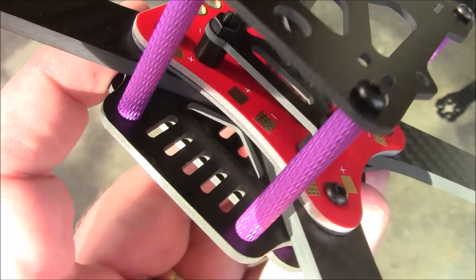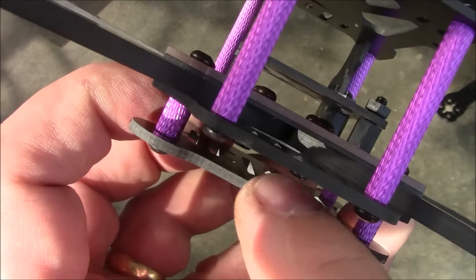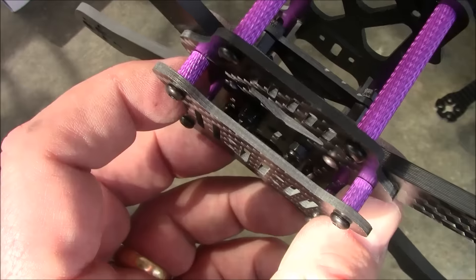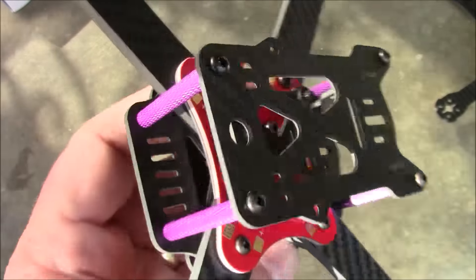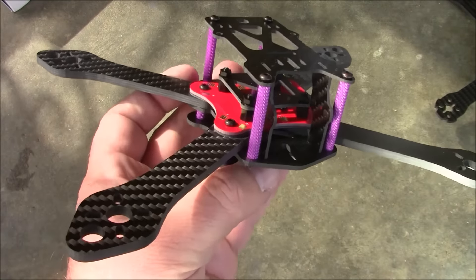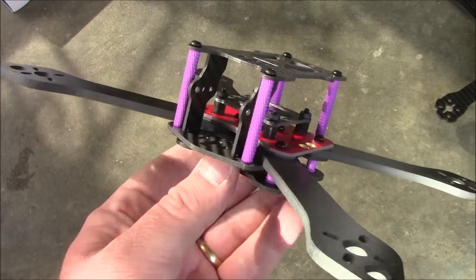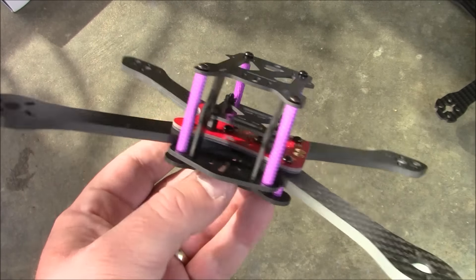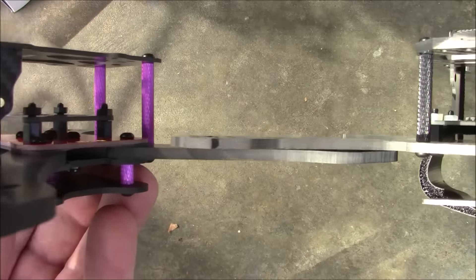If you keep all your components low it will give you enough room to stack them on top of each other. There's a little bit of space on the bottom where you can zip-tie something in place. Your receiver or video transmitter could go down below, but really the transmitter should probably be up near this antenna mounting hole. Four-millimeter plates also make good intermediate and advanced frames — it just depends on whether you're trying to minimize weight. If you are, you'd want to move to something like 3mm plates.